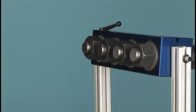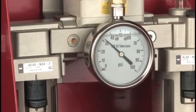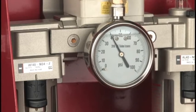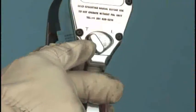To remove the nuts, reverse the process, this time beginning in low-speed power mode with the reaction arm in place. The effects of time and corrosion can make nuts or bolts more difficult to remove than they were to tighten. Since we don't care about achieving a specific torque value, turn up the air pressure to at or near its maximum, giving the tool its full power.